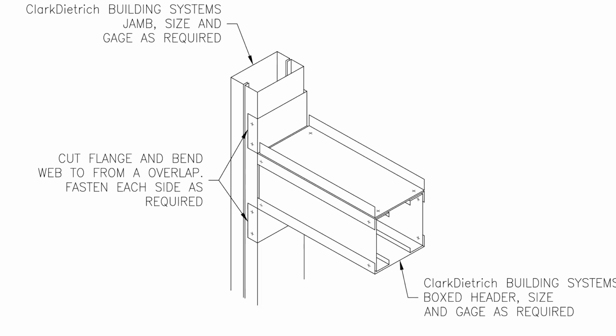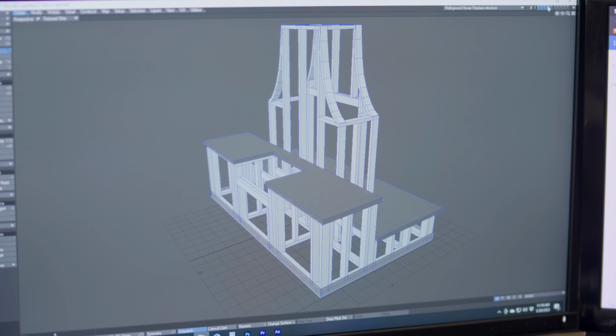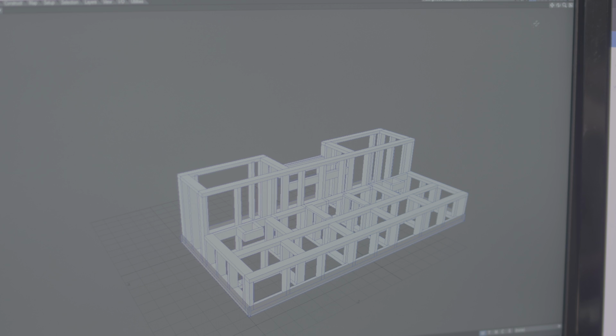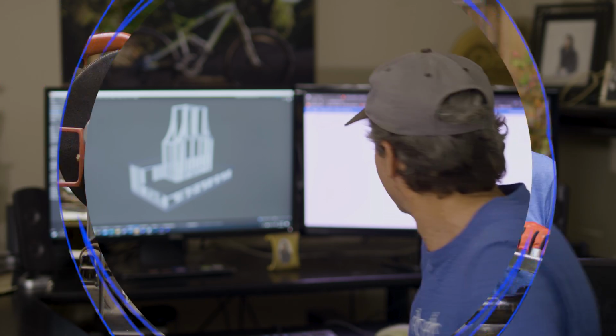I know this is just a fireplace and an outdoor kitchen, but I do want it to be structurally sound. The barbecue does have some weight to it, and I need it strong enough to be able to support some concrete countertops. I was going to build the fireplace section and lower seating section together as one unit, but then I decided it would be better to build the lower section first and then place the fireplace section on top of that. So I'm going to make myself a cut list so I can start cutting some metal studs. I have a lot of cutting to do.